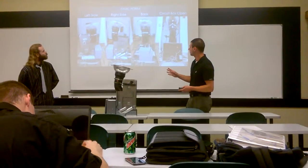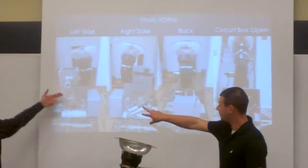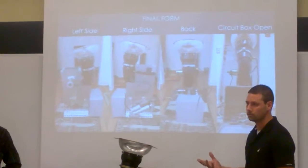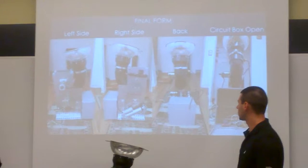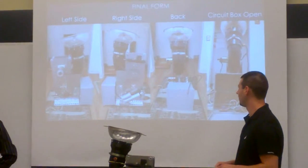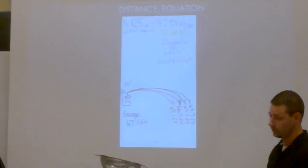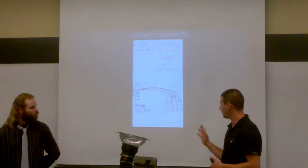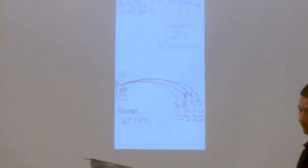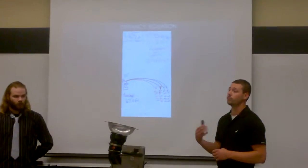This is our final 360-degree view of our project. We have our two motors outside, and in the future we would like to enclose these so that it's not a danger — no exposed electronics, motors, and spinning wheels. This is our equation for the initial velocity coming out of the launcher. With the distance we got, we averaged about 67 feet at a 35-degree angle. With the acceleration of gravity, the initial velocity came out to be 32 miles per hour, which I was pretty impressed by — I was thinking 40 feet, but it turned out to be closer to 70.